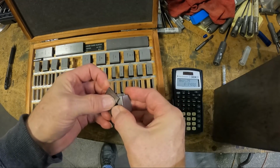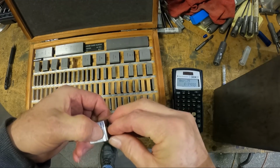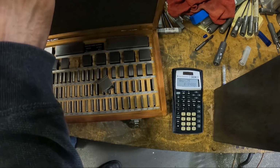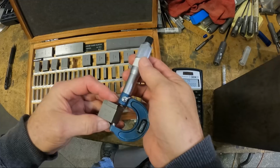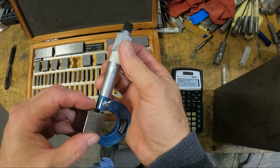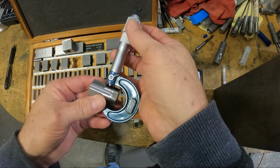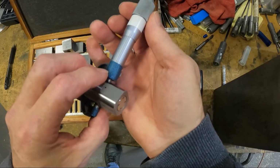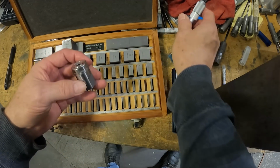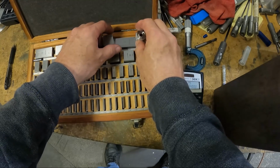Like this. Now let me get a micrometer. I got a big mess here right now. Okay, let's just measure that to be sure. 0.9843. That looks good. Let's get one of those spindle units. 3.9, we'll call it. So it's a little bit less, about 0.4 thousandths smaller than the actual 25 millimeters. That sort of makes sense for it to fit in a 25 millimeter holder.